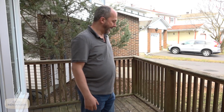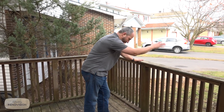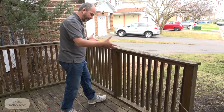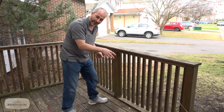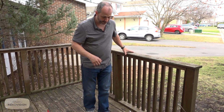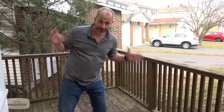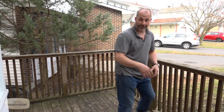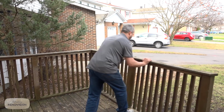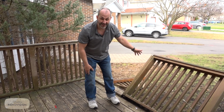and functional and safe. Because first of all, when you put a railing system and attach it to the surface of your deck and it has not really been built into the structure, it's not safe. The idea is this. In the engineering world, they use this concept of a 400-pound man, drunk, falling sideways into a railing. Is it going to keep him from falling off the building? Not in this situation. Somebody's going to get killed.